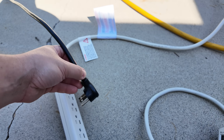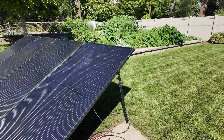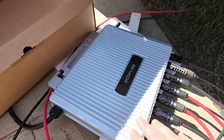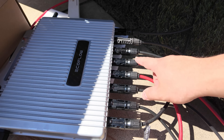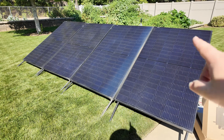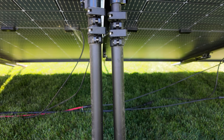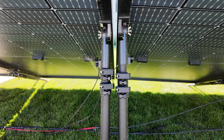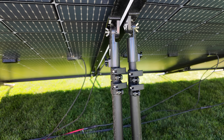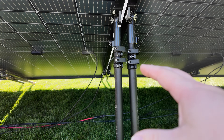Now we're going to take the plug from the solar and plug it into this power strip. I've got this box set up to shade the microinverter because it gets quite hot. The microinverter we're using is a 120 volt microinverter from EcoFlow — their Stream microinverter. Much like some of the big 240 volt inverters I've played with, this has four inputs on it, so I've been able to connect four 370 watt bifacial panels. Check out these nice stands — they telescope and pivot so you can really dial in your angles. They're from Powered Portable Solar, and I've got links in the description.